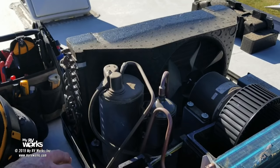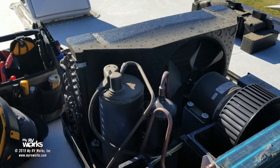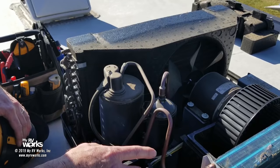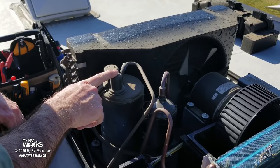If the compressor is not engaging, there are several things we could check, and you have to make a judgment call on what you're going to check first. Is it the control board inside, where you have a stuck relay? Is it the thermostat? Is it the compressor itself? Personally, I like to come up on the roof and check up here first, because I'm going to make the biggest splash. When I'm up on the roof, I'm going to check to make sure the motor is spinning, check the compressor, and I'm looking at other things too. By coming up here and spending a few minutes — haven't I also checked a whole bunch of other things? That's why I like starting at the top.